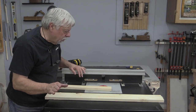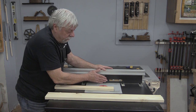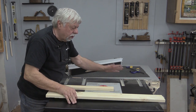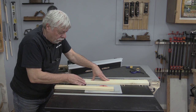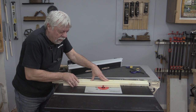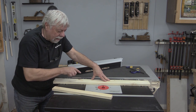The next thing I want to show you is how you can use your router table as a planer. First I want to remove my split fence — they're sometimes hard to align and I don't want the wood to pinch anywhere. I'm putting on a fixed fence that I've run through my jointer so it's absolutely straight and flat. We'll be pushing wood through the router and I don't want it to get caught or pinched between the blade and fence, just like on a table saw.